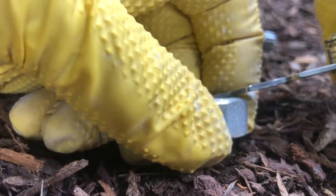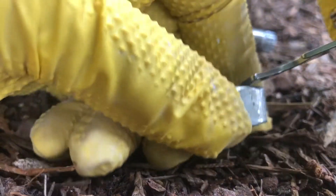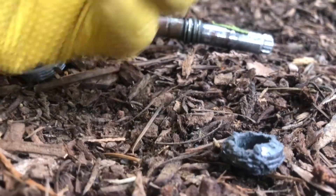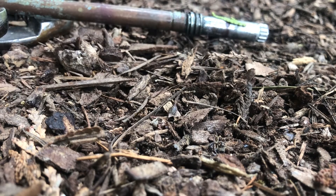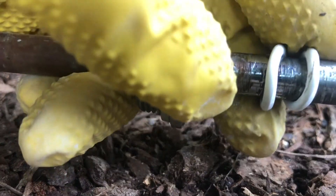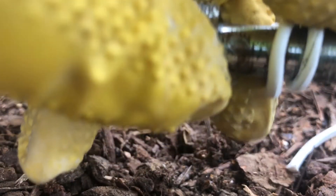The packing is just cracked. You push it out from the faucet handle side — just push it in and it'll come out the front side. I used a little screwdriver on the end of my Leatherman and pushed it out. That packing was pretty wasted. Then you use the Teflon cord packing — it's a Teflon material that mashes together as you put it on. First, put the nut back on. You can see the gasket there; if it's bad you'll have to replace it, but mine was good. Wrap the Teflon cord around there — you can cut it with scissors. I only put two wraps on, but after I assembled it, it was still dripping, so I pulled it back out and put a third wrap on.